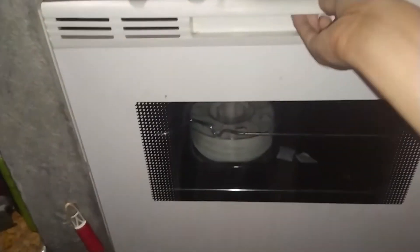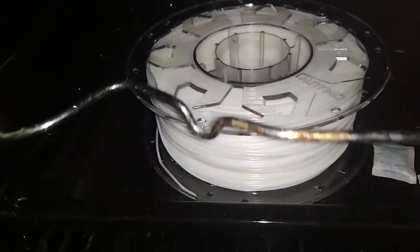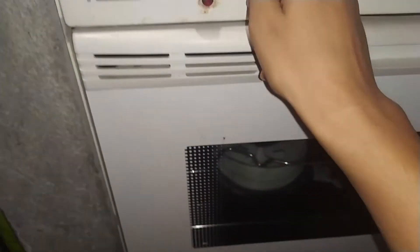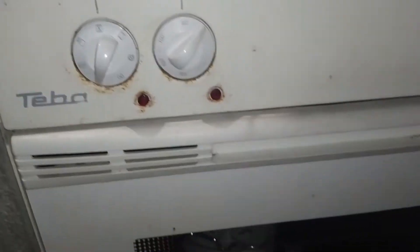It is important to ensure the dryness of the filament because its quality depends on how dry it is. We are located in a region with high humidity, that's why we have to preheat the filament at 50 degrees Celsius just to make sure it is dry. After an hour, the filament should be ready for printing.